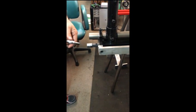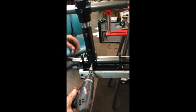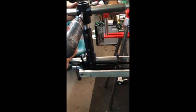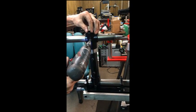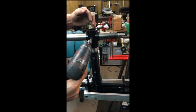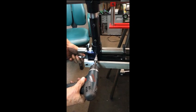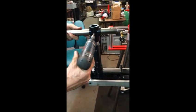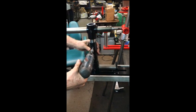We attach a five-eighths and use a power drill to drive the nut. Loosen the bottom set screw and you'll be able to turn and adjust finely, or you can loosen the top nut screw and do a gross adjustment at that level. So you have two levels: the top level for moving the bar itself, and the bottom level to move the lead screw. When turning or using the sphere jig, make sure the bottom is tight, the top is tight, and both of those two are tight.